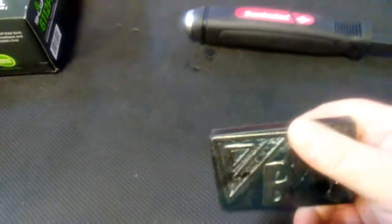Alright guys, sorry it's been a while since I've made an update. I've got quite a bit done here since the last time I've recorded anything. I've already got this all cut out, and see the color's kind of changed because I've already heated it up with a torch and tested it. But what I've done here is cut it down on a bandsaw, and then milled the edges through, and then milled the back side down, and then chamfered all the edges.